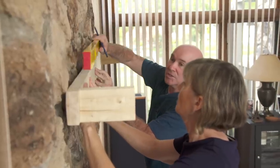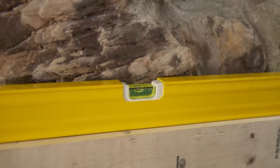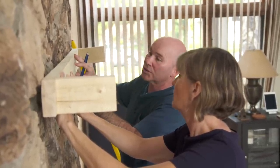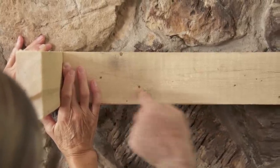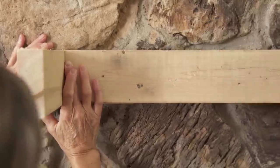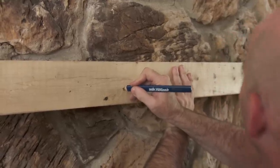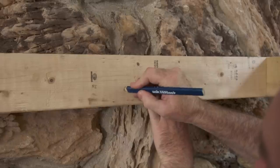Hold it securely because I'm going to put a level on it, which is very important. Looks like I have to come up — hold steady. Looking good right there. Now what we need to do is find some areas to drill our bolts. What I'm looking for is a mortar joint, preferably in between two stones, and I'll drill right through that. So I want to mark my 2x4 in between those two stones. I see a stone, I see a stone, there's a mortar joint — I'd like to go right in between those. So again, two stones here and here, there's my mortar joint, and I'm going to try to drive into that cavity.